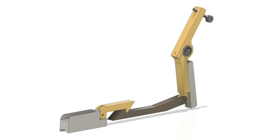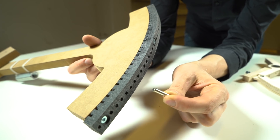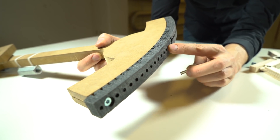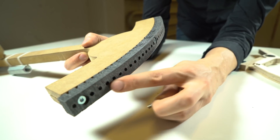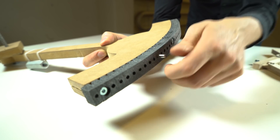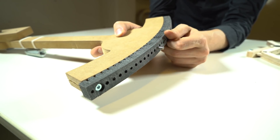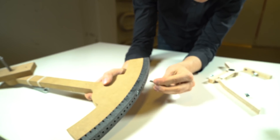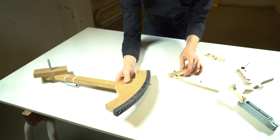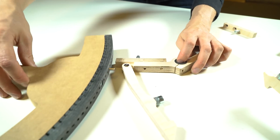And this is the new version of a marble gate — a huge improvement from the first machine — and that's the 3D printed part. So this is the test for the skin of the programming wheel. The programming pins are magnets, and under here we have a thin layer of metal. We routed these holes on the CNC machine, and these are the 16 notes of the music. I can put the programming pin in, it snaps in like that, the magnet holds it, and I can pull it out. Later this pin hits the registrator like this.